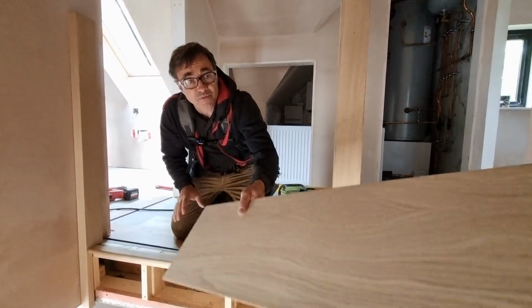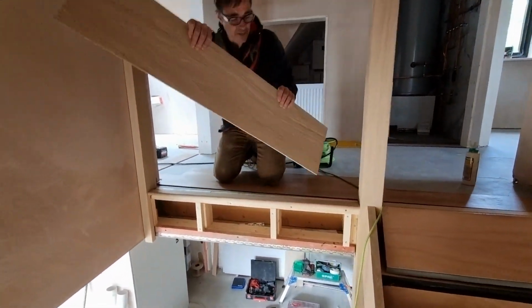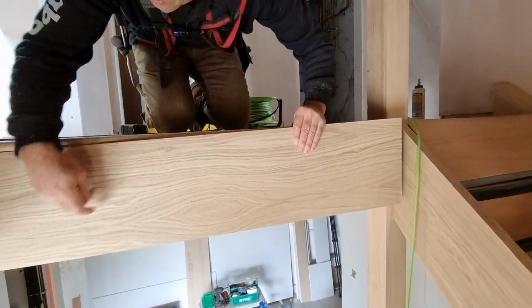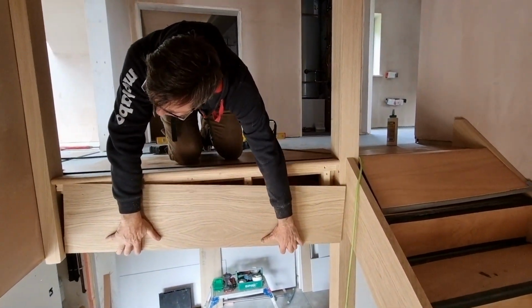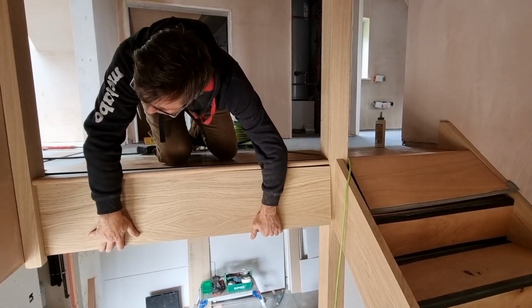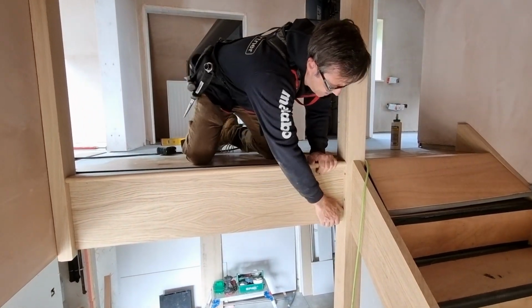So then we've got our apron here that we've pre-cut and shot in. I've got an arrow which references which way up it goes. So that would effectively do this. It would go in, I've just got to take out the relief for that last bit there. This is going to come up into our groove, into here, and straight in.